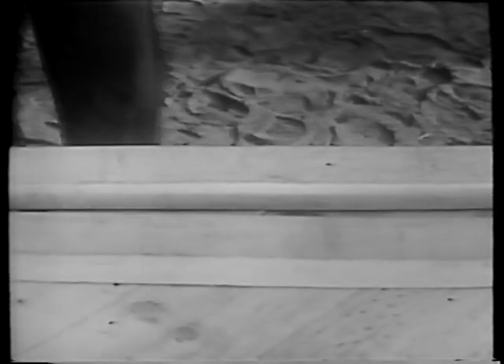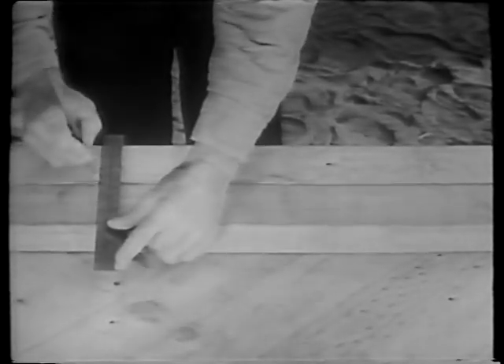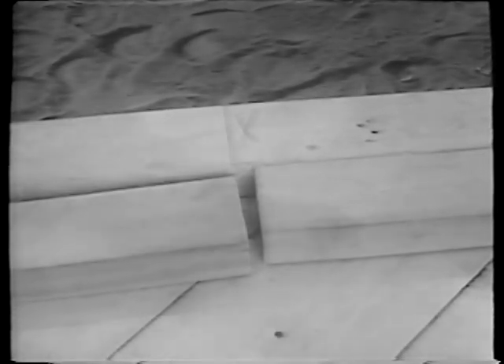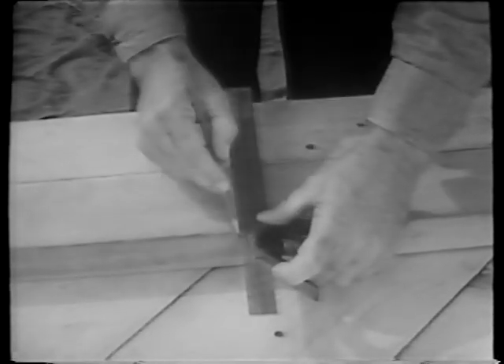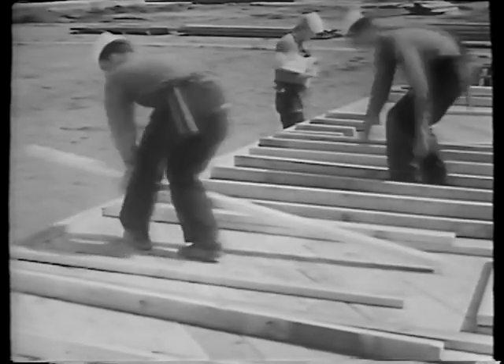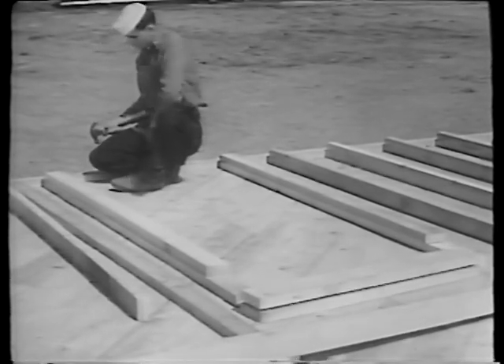After layout is completed, the top plates are placed on the floor alongside the sole plates. Top plates are the members which the studs will butt into at the top of the wall, the way they butt into sole plates at the bottom. Lines are carried across so that each top plate becomes an exact duplicate of its corresponding sole plate. When it is necessary to break the top plate because of material not being long enough, the break is made in the center of a stud, and if possible, away from door and window openings. With all plates marked, the studs, which have been cut to length, are laid down on the floor and positioned, ready for nailing. We now make up the door opening, beginning by nailing the trimmers to the door studs, using 16-penny nails driven slightly on a slant to increase the bond between the two members.